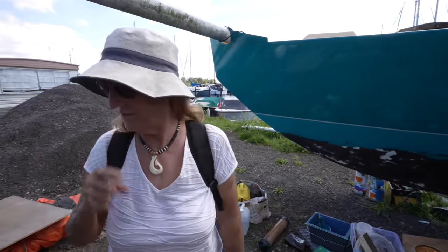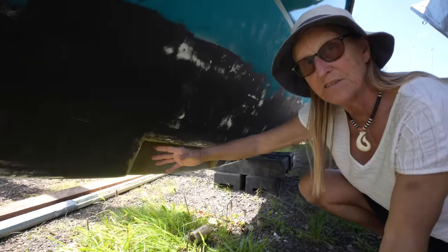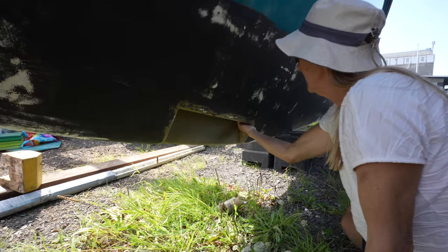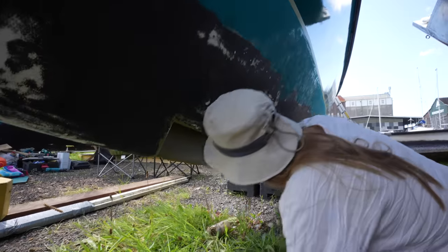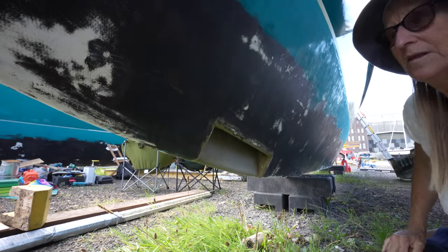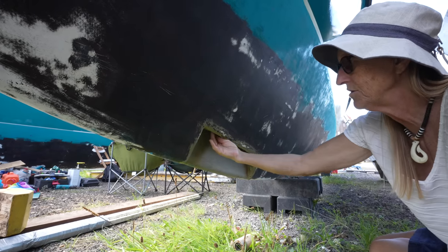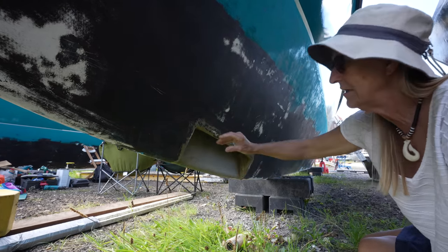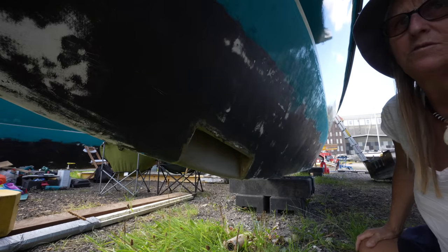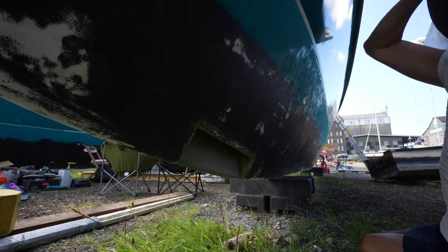One thing I was looking at when you were working with those centre boards: if you leave it like this, you're going to get a hell of a lot of turbulence when sailing. If you're not fitting a centre board, what I can see is there is some filler in there that was put in to fit the board better, as though there was a board once. I wonder whether there was a board once and you didn't get it. What you probably best do now is get some polyurethane foam and make that fit there, and then put a little bit of glass over it. It doesn't have to be very strong, just waterproof. And then put a waterproof cover on the deck as well.